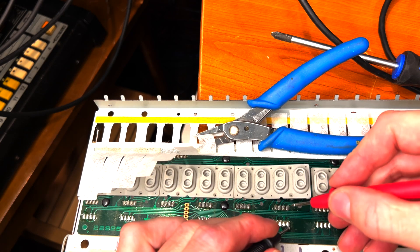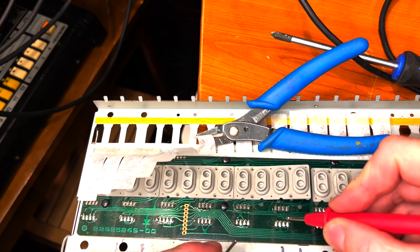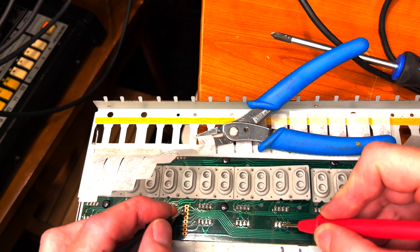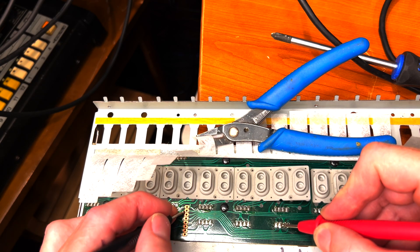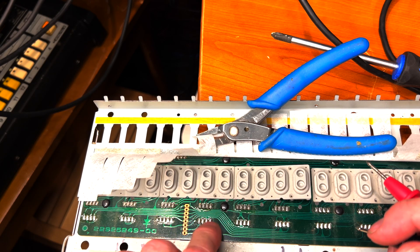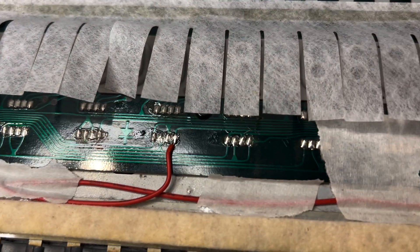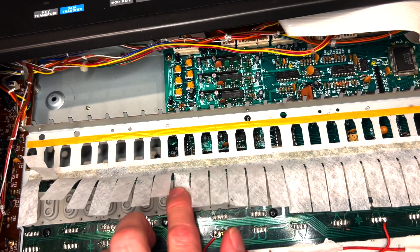You can see I marked the keys that were taped so I know where the traces are. Now I'm just going to ring out the traces and check continuity. That line's good, that line's good, but for some reason those lines are not good — so we do have some trace issues under the board as expected. I can see a little bit of trace damage there where my finger is. So we're just going to rebuild that trace. I've got some jumpers in now rebuilding those traces where they were just corroded away. It's sometimes hard to see, but once you ring it out you can easily diagnose those issues pretty quickly.